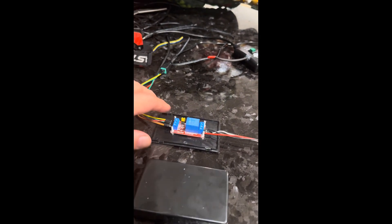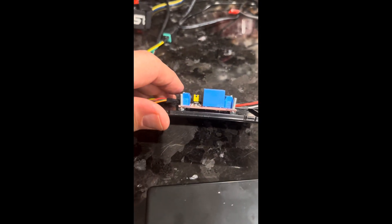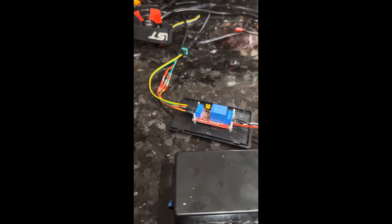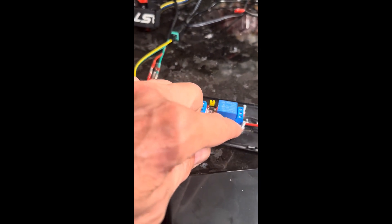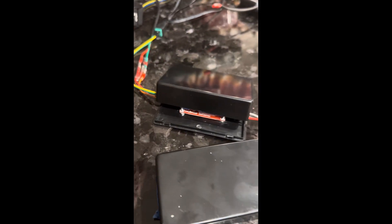So this is the box I used for the 5-volt relay — I got this idea from Maker's Cave. It works out great. Basically you just put some tape on the box and mark the holes where the relay terminals are, drill them, put a screw through there with a nut to hold the relay in. It's so shallow that it will not move at all inside once the lid is snapped down, because there's no space for a nut. Then you just cut a little notch on both sides to allow for the wires, and snap it down — you're good to go.